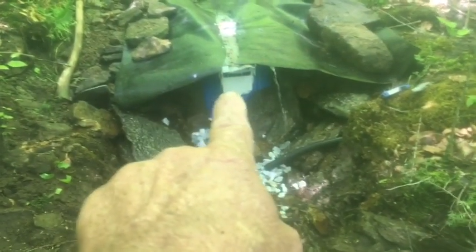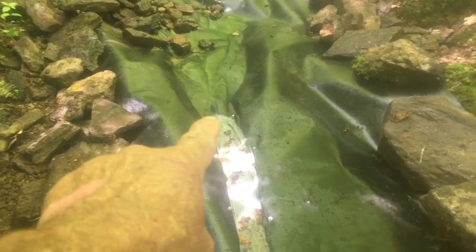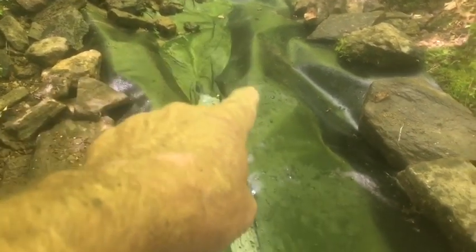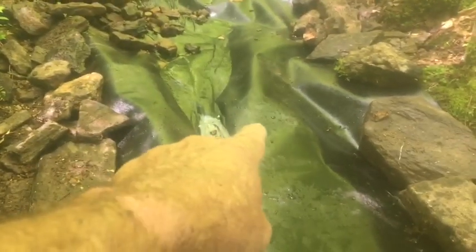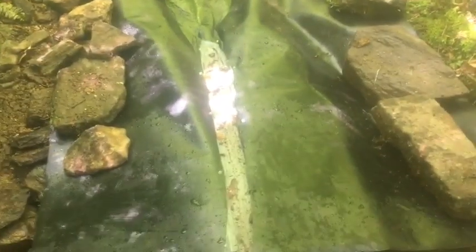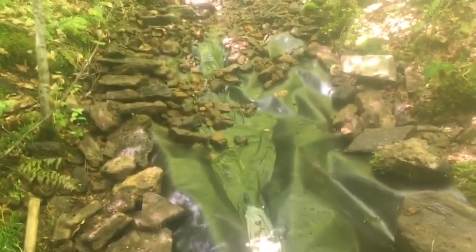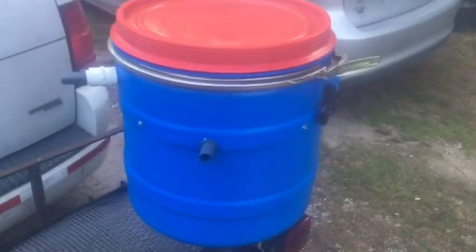Here it is - I had to put a gutter cap on it to back up enough water. The one-inch line is running full and it's working out really good. The water comes down, slides over the EPDM roofing, goes right into the slot, and it's going straight through that surgical stainless steel right into the catch basin. Hopefully when it rains next time it'll keep the dirt washed off, but it's already filtering out all the sand, grit, and gravel. This part of it is working.